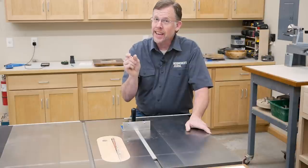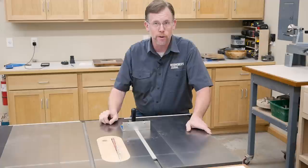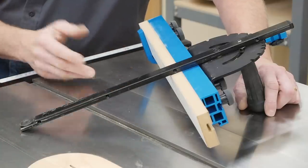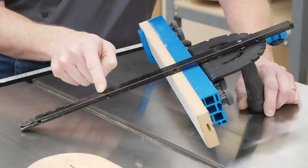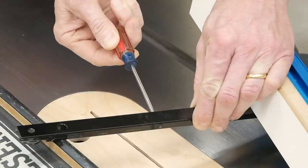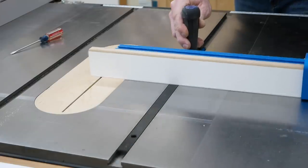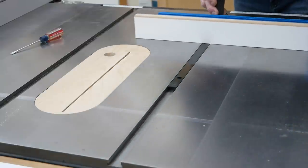Any deviations, even the really small ones, can impact how your miter joints fit together. But the bar on Rockler's miter gauge can account for any extra play. It's got four nylon adjuster screws installed along its length. Adjusting these tiny screws out effectively widens the bar to eliminate play, so it can slide smoothly without any unwanted slop.